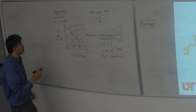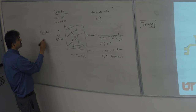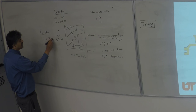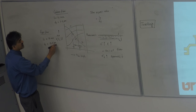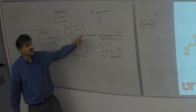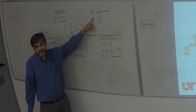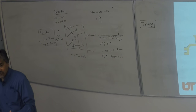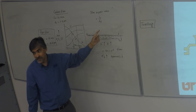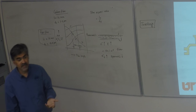As the diameter of the fiber gets smaller, the aspect ratio gets higher. For carbon fiber, you don't need very long fibers because the diameter is already pretty small. A quarter-inch or even 3 mm carbon fiber reaches its critical length right away. If the fiber reaches critical length, it means the fiber has to be at least slightly longer than that critical length to transfer interfacial stress between fiber and matrix.